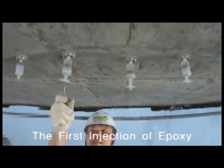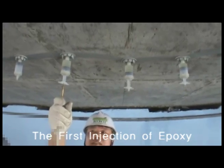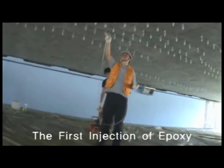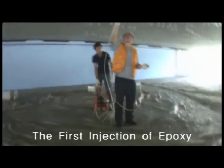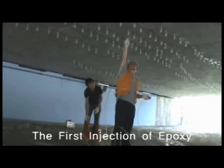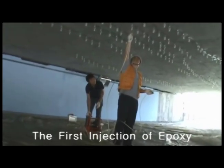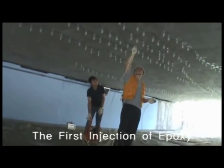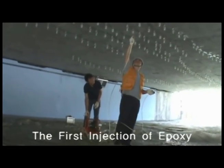There are two steps in the injection process: the first injection and second injection. Injection begins after the equipment's port nozzle section is adjoined with the K-Injector. It is injected until the crack injection resin fills the K-Injector capsule completely. After being filled, it is moved to another K-Injector and an injection process can begin.